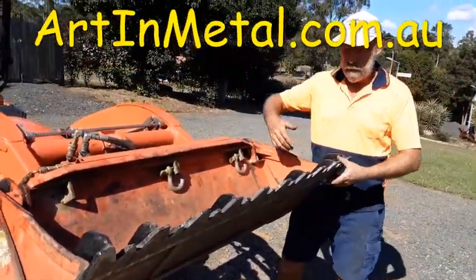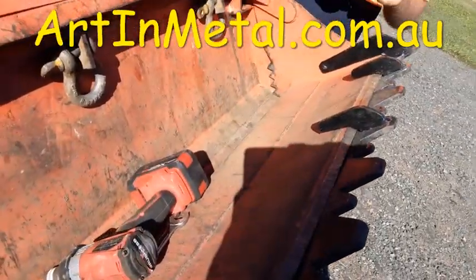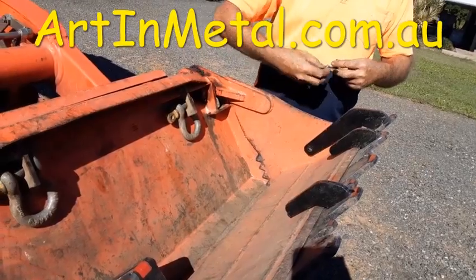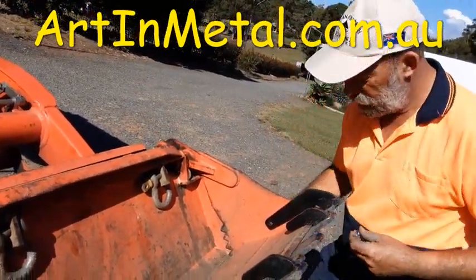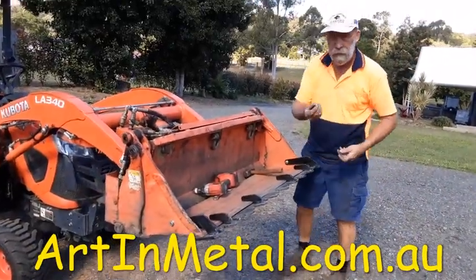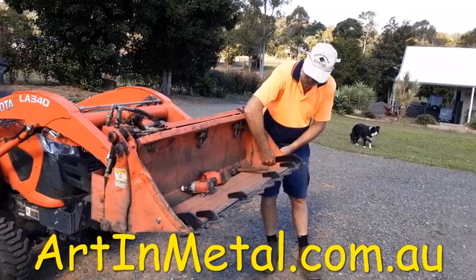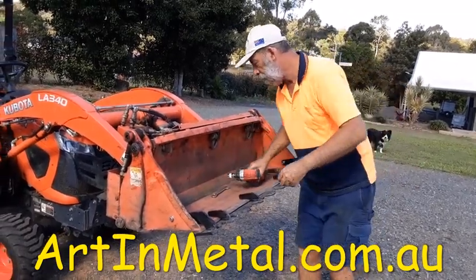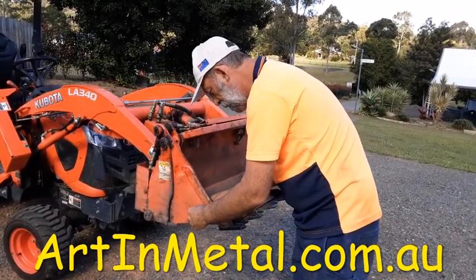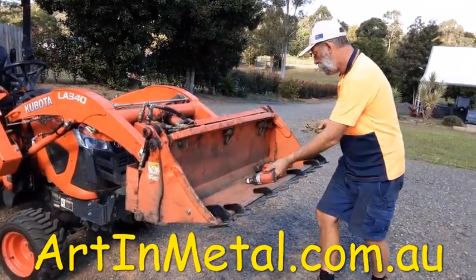So once you've got that all in position and you're happy with that, you need to mark and drill these holes. So for the bolts, now obviously this has been installed on my bucket before, so they're pre-drilled, so we won't go through using a drill and how to do that. Now normally bring these bolts from the outside in, washer on either side, and a nylock nut. And tighten him up.